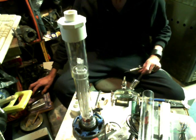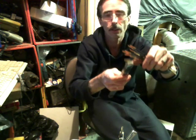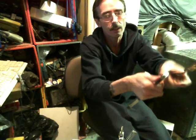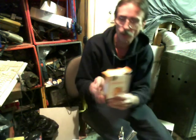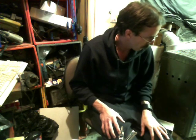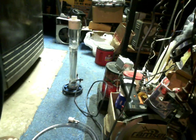Something I failed to mention: these plates right here, every other one would be positive and negative. How I connected them was that I stripped the wire a little far so I could overlap it twice, then folded the metal over and crimped it down, and taped around it with epoxy at the bottom. Also, in order to give the water a little more conductivity, I put about a teaspoon of baking soda in the water. I've got the water in there right now, so I'll reset my camera and then we'll see if this thing bubbles.